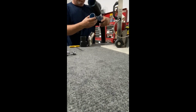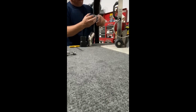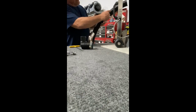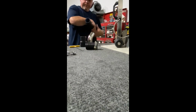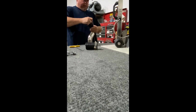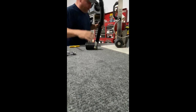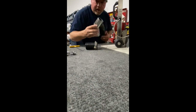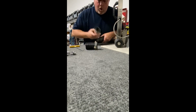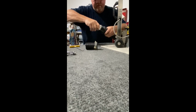Now I have a spacer, and the spacer is about 3 inches. You want to see about 1.5 to 2 inches inside of each side of the hose evenly in this area. I use this as a spacer. It's about 3 inches. I put my cuff on, and I might have to move the camera, bring the machine down to show you the rest here. I also dunk this in the water. Now this has a short side and a long side. The long side goes down in this cuff till it reaches the bottom. You'll feel it hit. As soon as it hits, you're good.